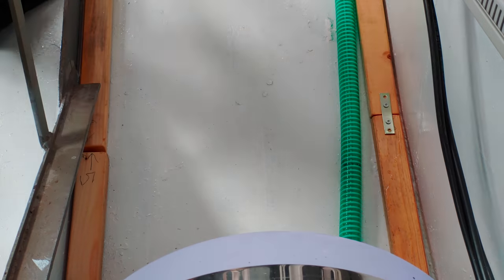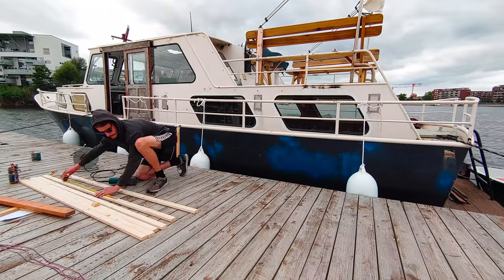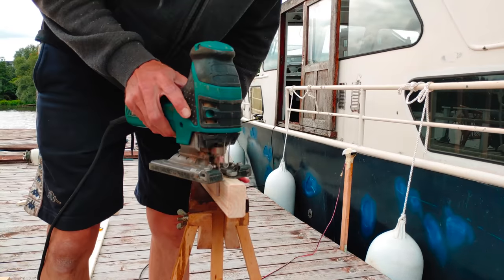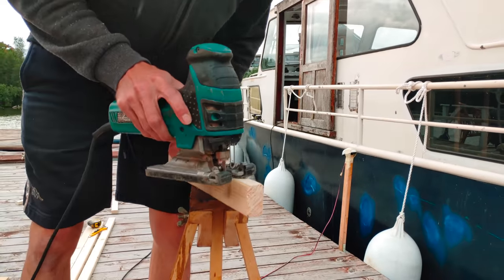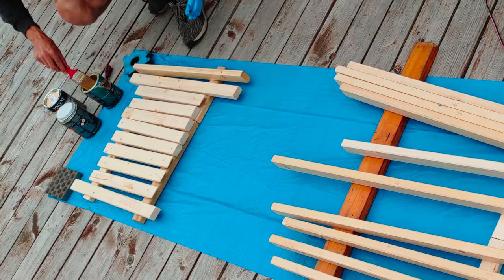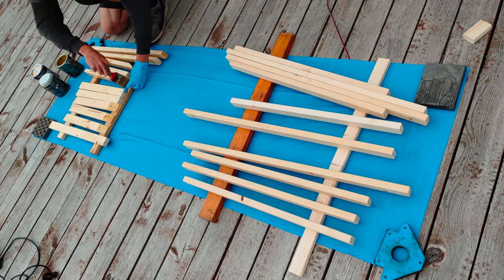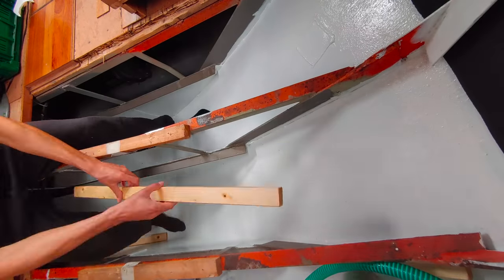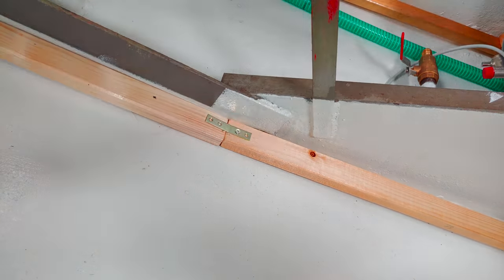A few more brackets to keep the timber in place, and then this compartment is almost done. Next, I'm going to cut the timber for the other two compartments and cut more of these bridges. Once again, I'm painting all the wood with boat lacquer. Now let's put the wooden structure in place. The wooden timbers from each side don't go all the way down to the bottom of the bilge, as this would block the nuisance water from flowing all the way down to the bilge pump.